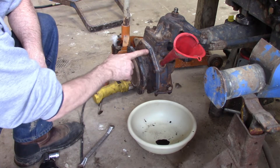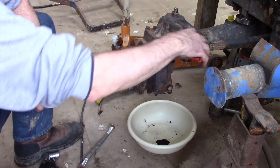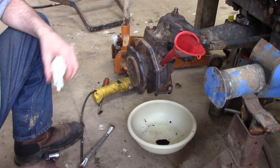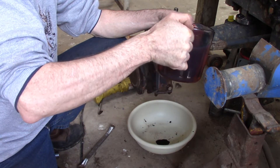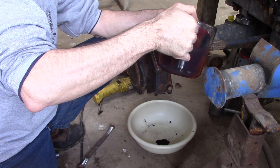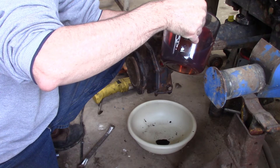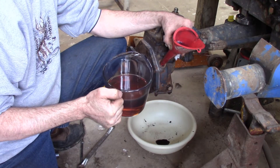I've got these all back together. The bolts are all tightened — top, front, and bottom. Let it sit for a little while for the silicone to set up so it's not too soft. Up top here is a fill hole, and down on the bottom that nut is a drain hole — take this plug out, it drains, and then you fill at the top. They say this is just like a rear end of a car — you fill it up until it starts running out. The funnel came out and it was already full, so it's back draining.